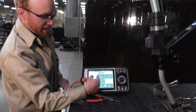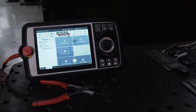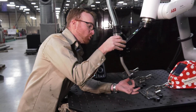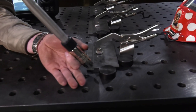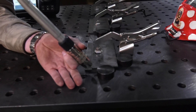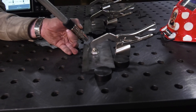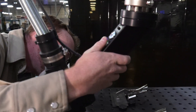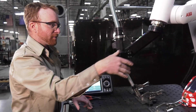From here it's going to ask what we want to do — a linear weld, a circular weld, or whatever. We're going to go with a linear weld for this. We're then going to move our torch to that first weld location, press the green button, then move to the next location or the end of the weld, and click and hold the green button. Then we're going to move our torch out of the way.